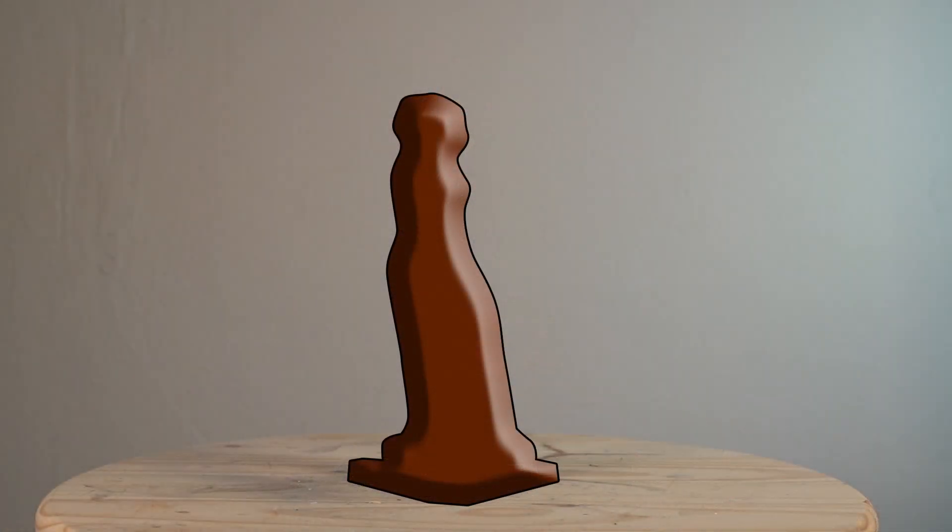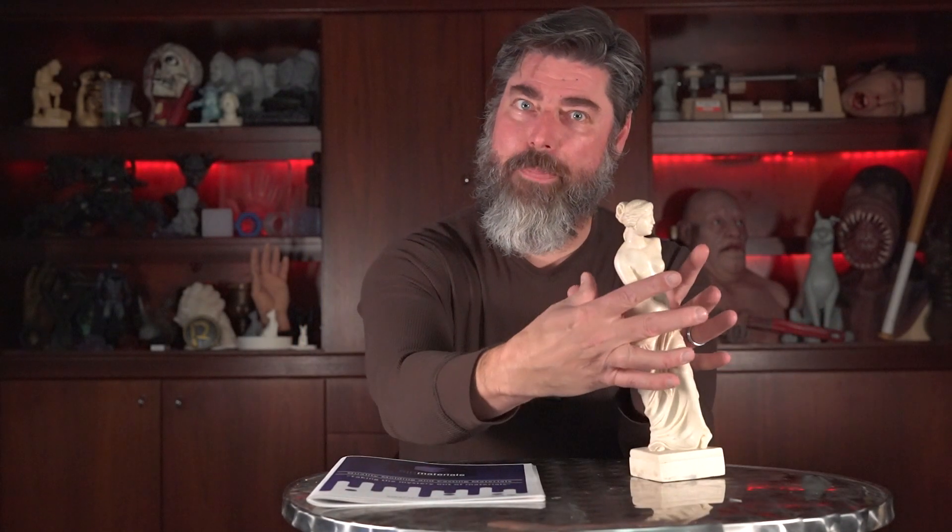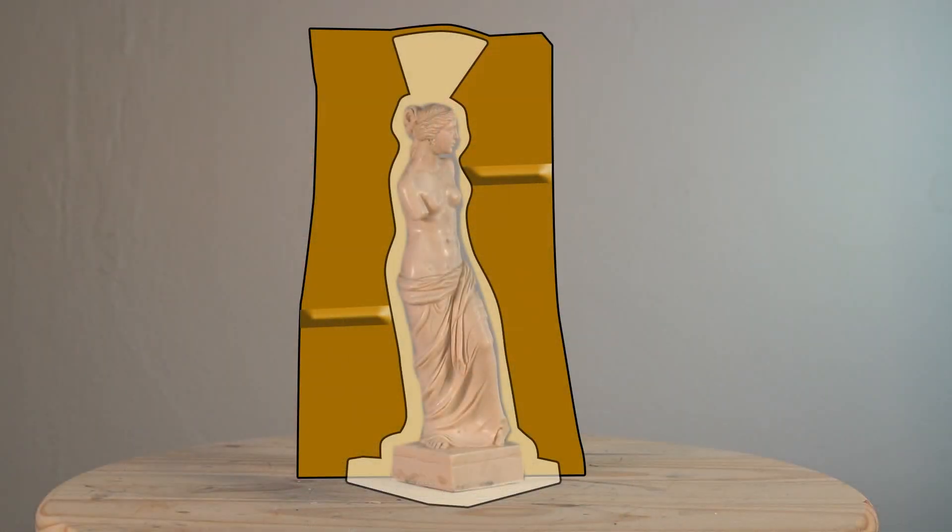In this case it's going to be a pretty basic two-piece shell going corner to corner. I'll build a two-piece resin shell, and one important thing is I'm going to need to build a pour spout on the top of her head, because ultimately when this is filled with silicone it's going to be filled through the top. Once that mother mold is done, I'll pry those two pieces apart, remove all the clay, and then reassemble that around my master. That gives me a cavity — which is where we get the terminology of a cavity pour.